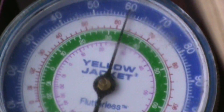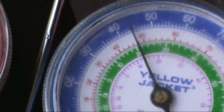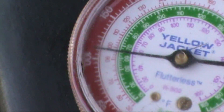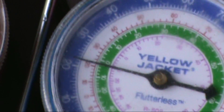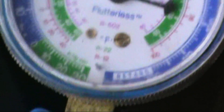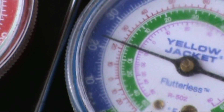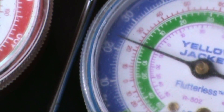The pressure is starting to drop between the cans — it's starting to empty out. Our pressure on the high side came up a little bit, we're a little over 100. So we're still dumping refrigerant. Right now we're a little over 20 psi. I'm going to go ahead and take a temperature reading and we'll look at the cycle.